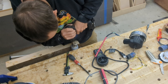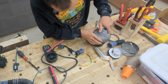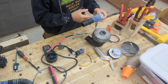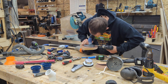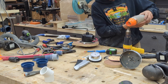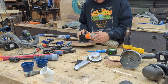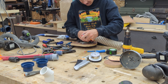For the intake hose, I'm using a PVC conduit fitting I had lying around. It was almost the right size to slip over the metal port, so I just bored it out a bit with a Forstner bit and it slipped on very nicely. The Rockler hose kit I've been using has an adapter that screws onto the threaded side of that fitting — a very snug fit. I then used a few screws and gasket material to make an airtight seal. On the exhaust side, I reused the old exhaust hose from the first version. The orange lock-line nozzle I cut slightly, then softened with a heat gun to slide over the exhaust port, and used a hose clamp to form it into a tight seal.